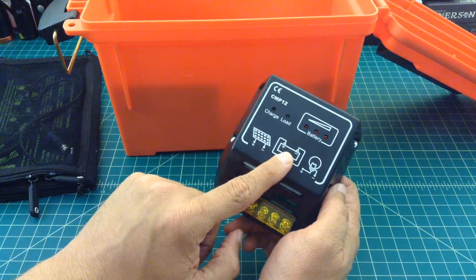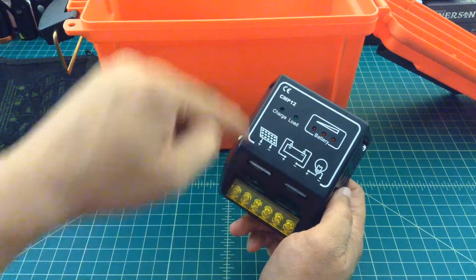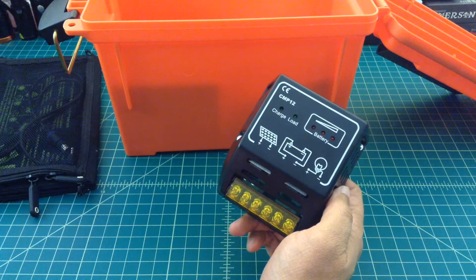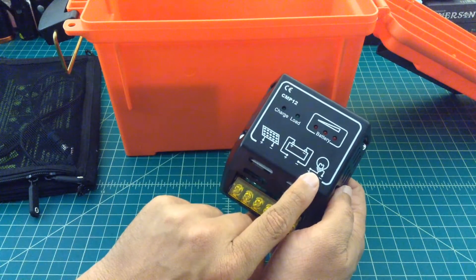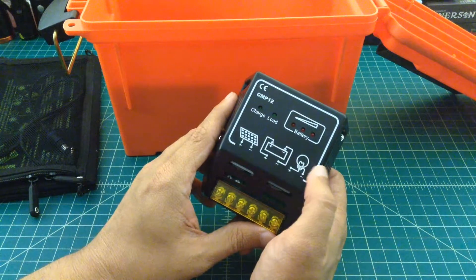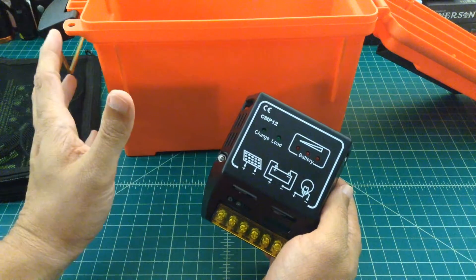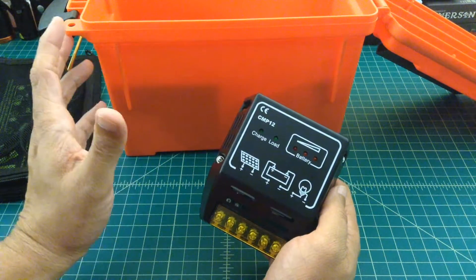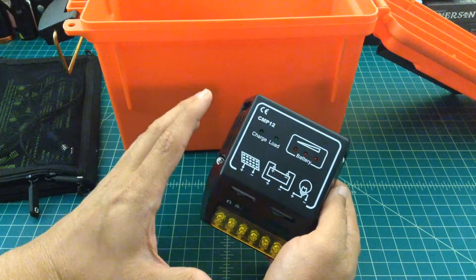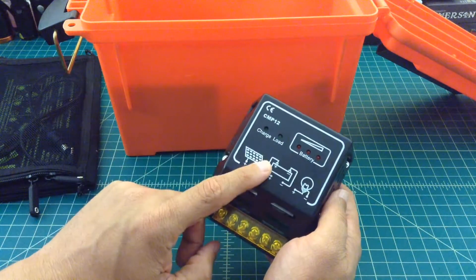You hook your output to your battery on these two ports. As power comes in, it goes out on these two, and when your battery charges a device, it comes in on those two. This is how you connect your devices up to these ports. What's important is it also protects you from undercharging your battery. Lead sealed batteries — and lots of other batteries too — can become damaged or dangerous when they get undercharged. So you want overcharge and undercharge protection, and we've got it here.